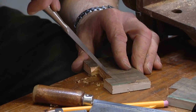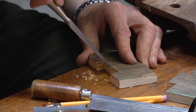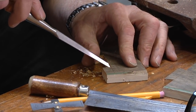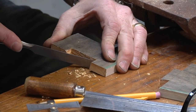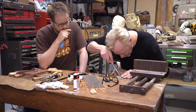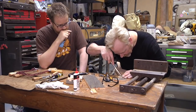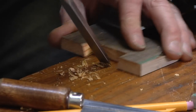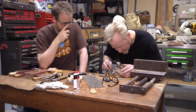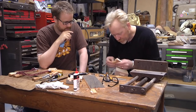Now we're getting somewhere — this is looking a little bit nicer. What I've noticed is that dovetailers tend to cut this little corner cut at a slightly cheated angle so that they cheat it towards the inside and the show side ends up matching really nicely. So I'm going to try and cut it a little less than 90 degrees to get the same result. That looks pretty good. What are you doing to that nice table, Adam? It's not that nice a table — it's really old. Well, this is the point of having a workbench table.